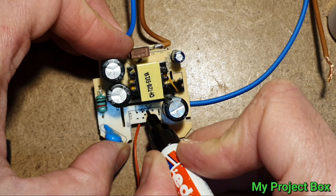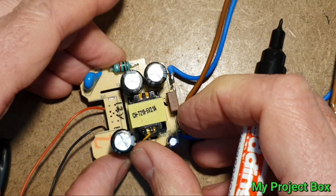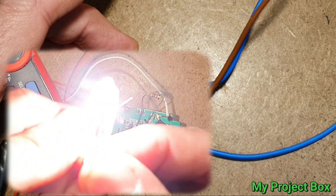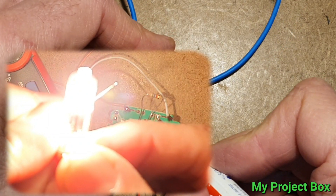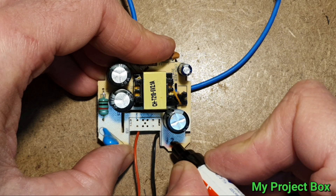On the output I decided to test the 12 volt output with a load, so I used a 12 volt halogen bulb — that's 20 watts, which is plenty — and it lit it no problem. So 20 watts at 12 volt, it can handle a bit of current. It's also a really good way to burn your fingers.